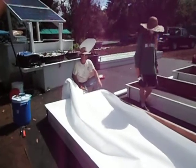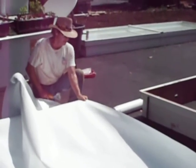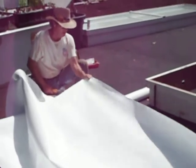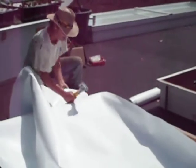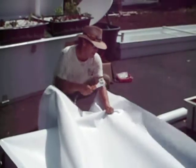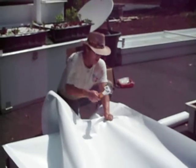Now, we're going to show you how to start. We're going to do the other side of this side. Larry pointed out something really important: you pull on the edge. See how I've got this holding this by the edge? I'm pulling the edge here. If I grab here and pull out in the middle and staple the edge, the edge is going to be loose and I'm going to have wrinkles all along that edge. This will be all messed up.